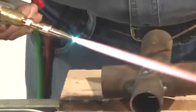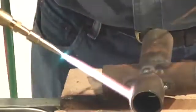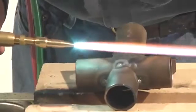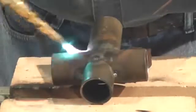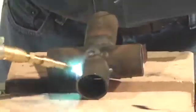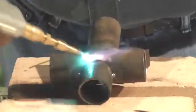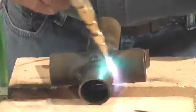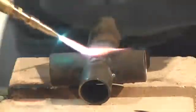It's always good to preheat and post heat, but .063 and under is not as critical. For chrome moly tubing you always want to preheat at least 300 degrees. Especially if you're doing cluster joints — sometimes you're doing a rosette weld, tubing inside of another one. So always preheat at least 300 degrees on chrome moly tubing. You want to preheat, post heat, and stress relieve it.